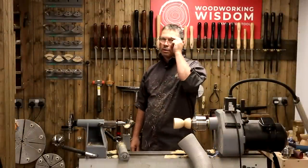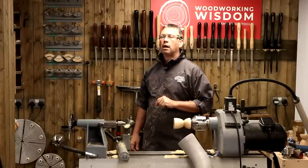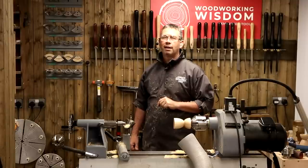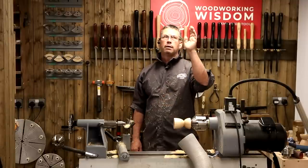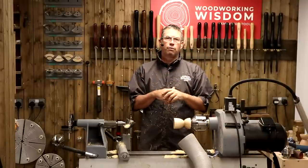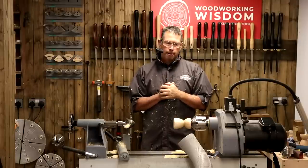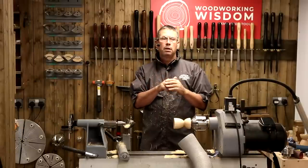Yes, Ben, question. Alan's asking, do you ever use a bowl gouge with a standard grind? What do you call a standard grind, Alan? Because there isn't one. There's so many grinds. If you're talking direct from the shop, so flat with nothing on, no. Yeah, those corners are too far in the way. That's a blank. That's ready for you to sharpen your own shape on. With a very little curve on the end, yes, I will.